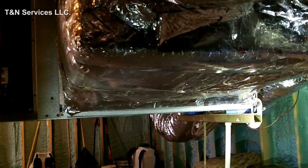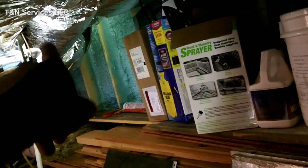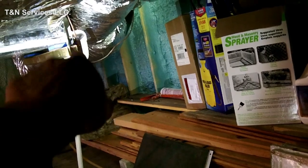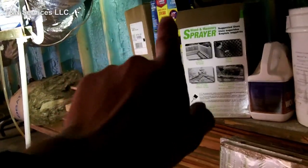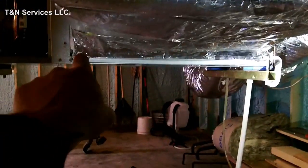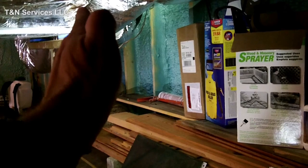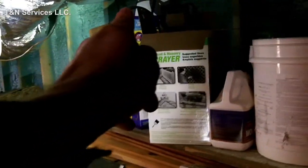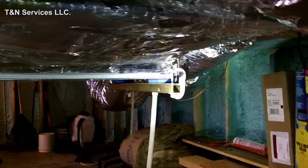I have assessed the damage and the coil. I had to take this return from them down and disconnect this duct right here because it runs back that way. The blower and the coil are just on the other side where that trap is there. So I had to get in that little area right there, and I think there's enough room for the coil to slide out. It doesn't look like it is, but I measured it — it starts right there at the edge of the return plenum and goes to over there. I'm hoping there's enough room to pull it from there to the wall and get the thing out.